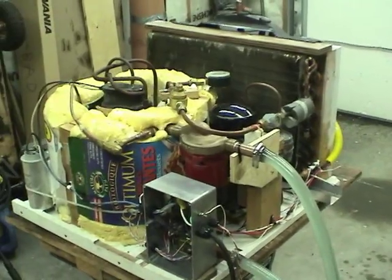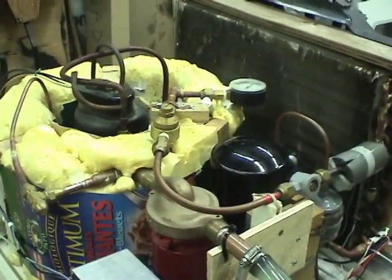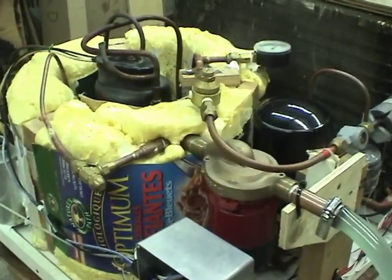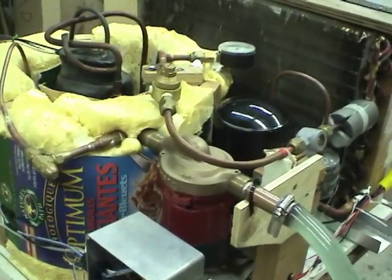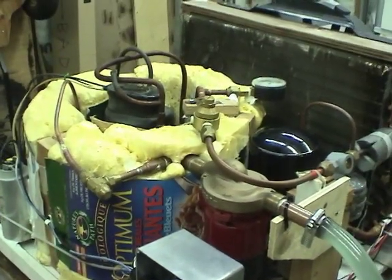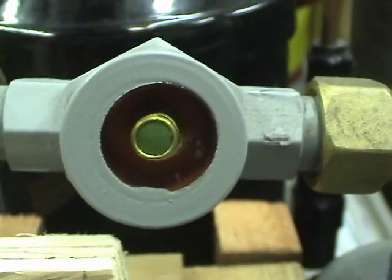I should have more videos later on once this is installed to show you how it looks. Thanks for watching. One thing I forgot to mention is that in this system I'm using refrigerant R290, which operates at a slightly lower pressure than R22. This is needed because the condensing pressure would be too high with R22 due to the high condensing temperature of around 60 or 70 degrees Celsius, which is much higher than you'd normally run in an air conditioner. R290 runs at just the right amount lower so that the condensing pressure in this system is about the same as it was in the stock air conditioner. The temperature is going up quite quickly now, and the suction side sight glass has mostly cleared out.